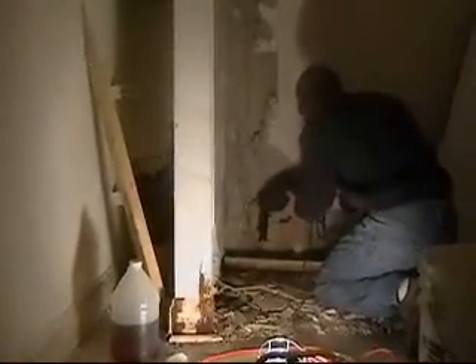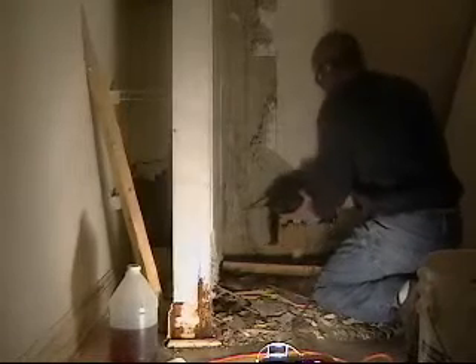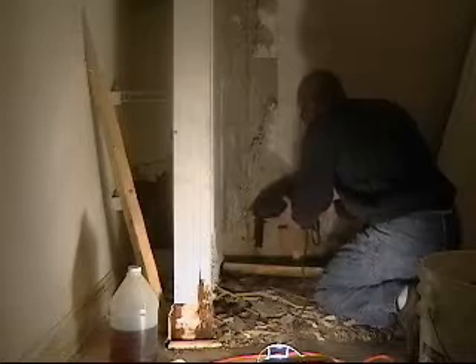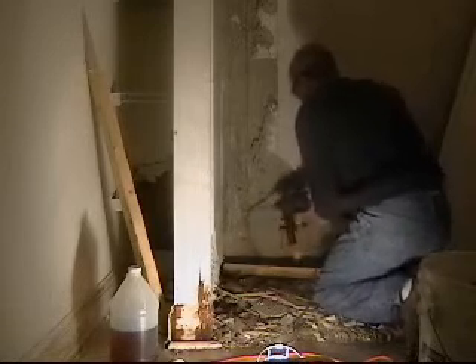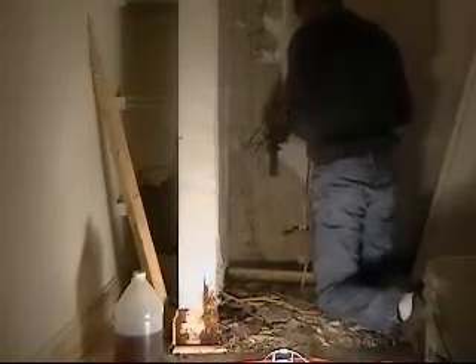We're going to do this about every 8 inches all the way up the wall. You want to bore out the very start of the hole a little bit — the packers tend to be 3/8 or 1/2 inch (they're actually in millimeters, so slightly bigger than 3/8 or 1/2 inch). The gasket on it is about an inch long, recessed into the wall, so bore that out just a little bit at the beginning and it'll slide in much easier when you go to put the packer in.